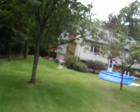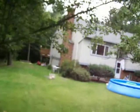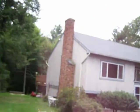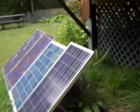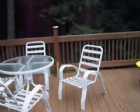I used to have 9 Harbor Freight 15 watt panels on the back side of my roof, but I had a new roof put on, new shingles, so I took those off. Now I have just a little rack on the ground out back here. Everything's growing in now. See here, I got a 90 watt panel, one 80 watt panel, and two homemade panels. They're each probably about 75 to 80 watts. So that's the array. I usually just keep that on my batteries, but I can switch it over to the grid tie inverter that I have inside. It's just a smaller 250 watt grid tie inverter.